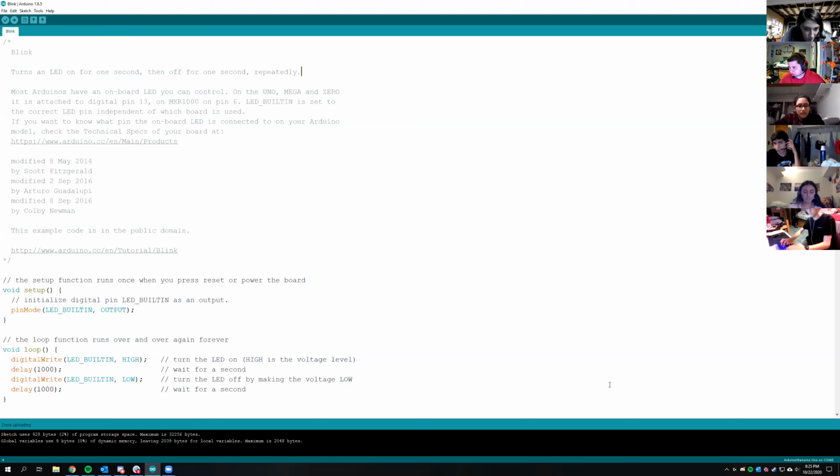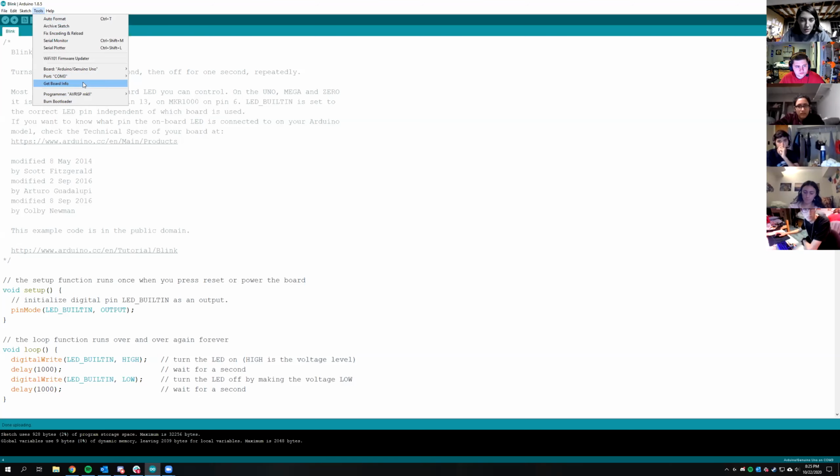My port button is grayed out. Oh, you need drivers. Are you in Cornerstone or no? Yes, I am, and my SparkFun RedBoard works fine. You shouldn't need drivers for this board because it uses an FTDI chip instead of the CH340, which I think is what that SparkFun kit uses. So Trey, you're just not seeing anything under serial ports? Yeah, the port button is just grayed out. It won't let me click on it.